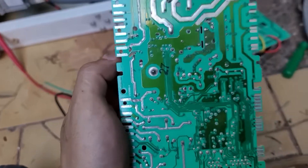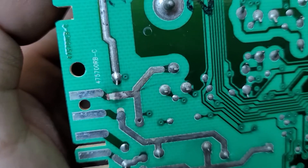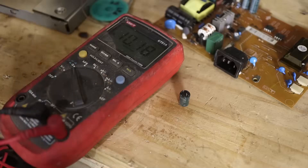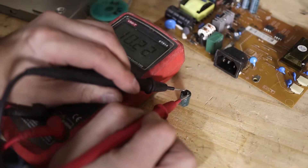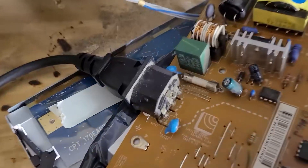Having ruled out the fuse, we start to observe the power supply. For example, when I showed you how to repair washing machines, the board had some swept tracks. You can also look for this on the board. And if you don't find anything related, it's very likely a capacitor. Capacitors are those metallic cylinders you see, and you should check if they are swollen. This power supply had several swollen ones, so I removed them — taking a picture beforehand to remember how they were — and looked for a replacement. We simply see that on one side it says the voltage and the farads. With those same values we buy an identical one and solder it back just as the original was. Once changed, we check again, and in this monitor it was just that, so it started working again.